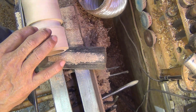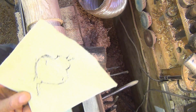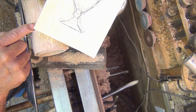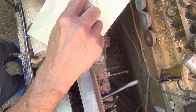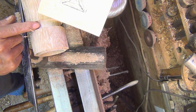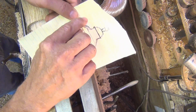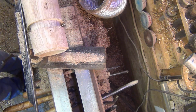So the lid, according to this, is actually sitting on the inside and not the outside. And what I was just doing here would force the lid to be over the size of the neck. But I can still maintain that to be that way by shaping this up to do a little bit of this curvature that I want here. So I'll do that before parting this off.